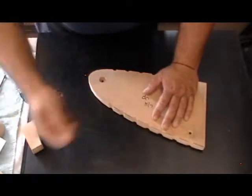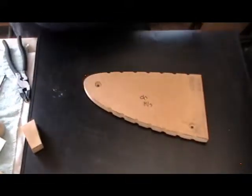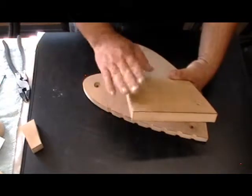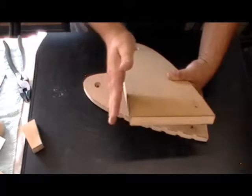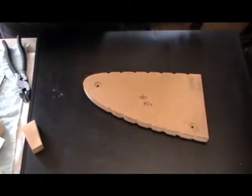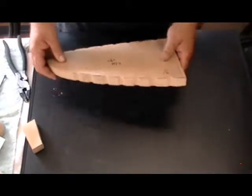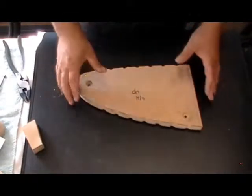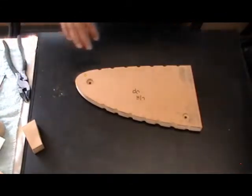I made this form block with the same identical shape as the original, then milled in holes for the flutes to sit into. The problem was the flanges were pounding flat against a 90-degree edge, and anyone who's worked with sheet metal knows there's spring-back — you pound it flat, it springs back. So you have to pound it past flat so it springs back to flat. I milled in a five-degree relief all the way around on the sanding table. Now when I pound it, I pound it past 90 to 95 degrees and it springs back to 90.